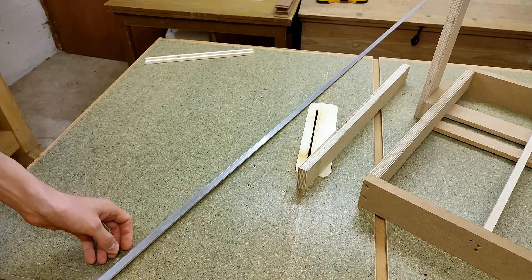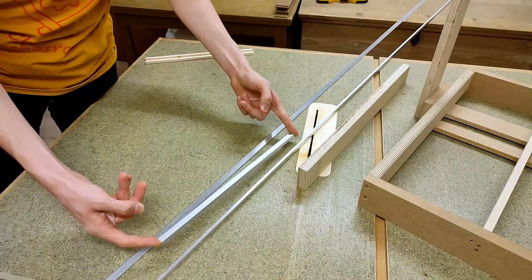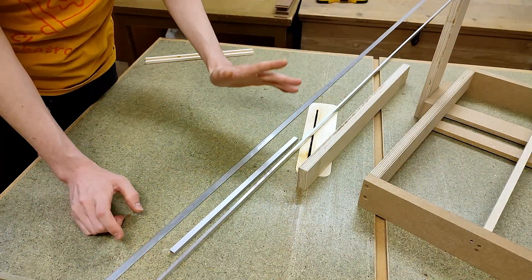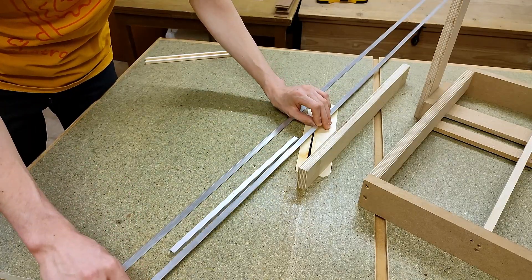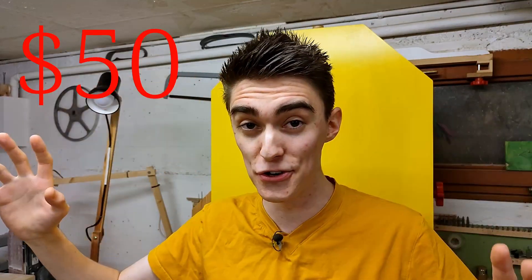The aluminum angle stock I'm going to use is this stuff here — it's 10x10x1mm thick, basically the cheapest one I could find at my local hardware store, which is also why it isn't anodized. An anodized surface would be slightly more wear resistant, but it's also more expensive. After all, the fun challenge of the $50 budget for the entire printer was cutting costs wherever possible without it affecting the end result too much and leading to a crappy printer.